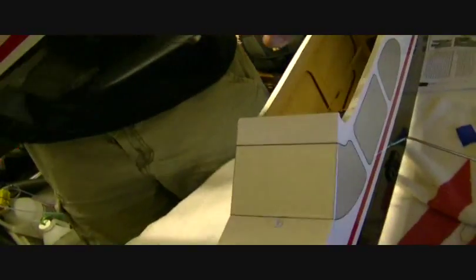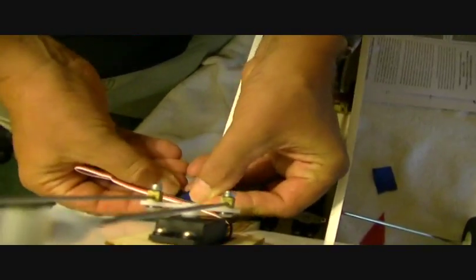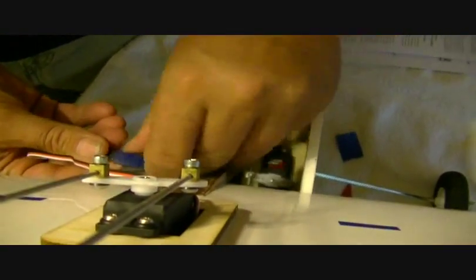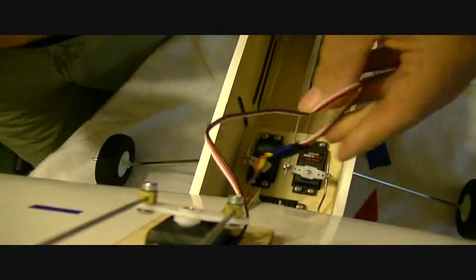Anyway, we're fixing to put the wing back on it and plug the ailerons in. Bill, I'll let you. I'm just going to put one of these on it because I always like to have one. Yeah, I leave it on this end is what I do. I'll hold the wing. We don't need it on right now, but I got one out because it's going to need it. Yeah, always use a safety clip on your aileron wires, and on the battery wire that goes to the switch lead, so they do not come loose. Now these are fitting awful tight. Really? Golly. It fit. Got it in. Yeah, dark to dark. Okay. All right, now just kind of stuff the wiring up toward the front as you put that on. And here's your bolts.